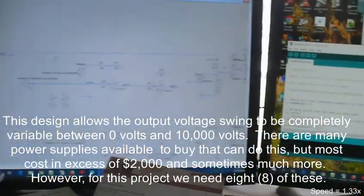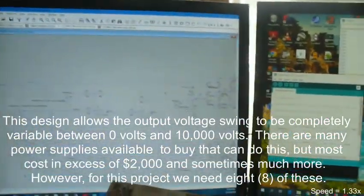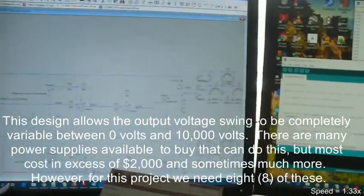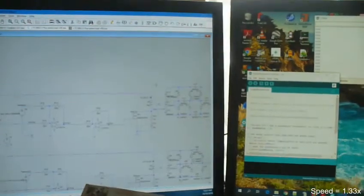Now that's the 100 volt supply, and it feeds this inductor over here, which feeds another side. This is transformer 2, yet another transformer. This transformer goes out to voltage doublers and more doublers and more doublers. Now the ratio of these is 101 to 31.62.